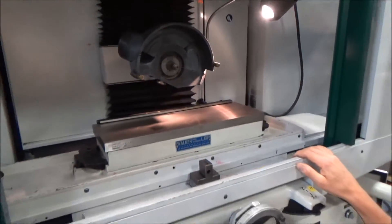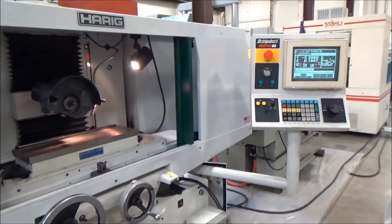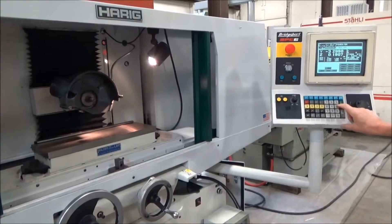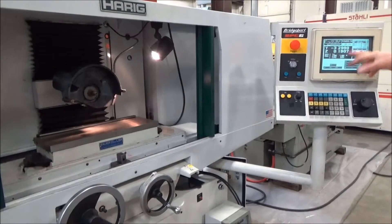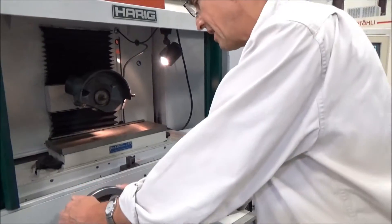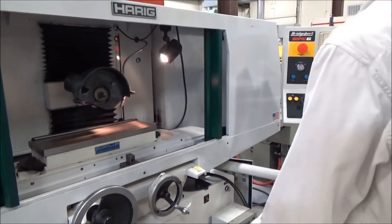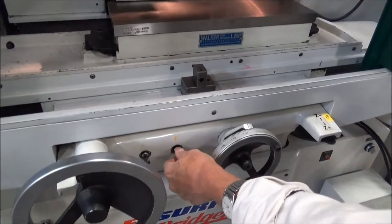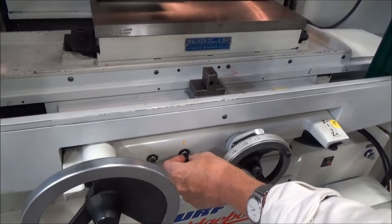That's good to go. I'm going to leave it on because I'm going to throw in a surface program — we need that running anyway. Let's do a table reset. I'll do an event — do event, set table reset. Six inches to 11 inches, it's a five-inch pass. Disengage hand wheel — there we go. There it goes. With this one we've got full control. It has nothing to do with the feed dial; it's all hydraulic. Here's one way slow down.